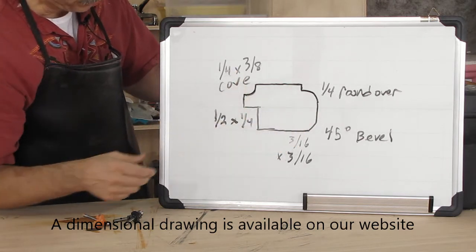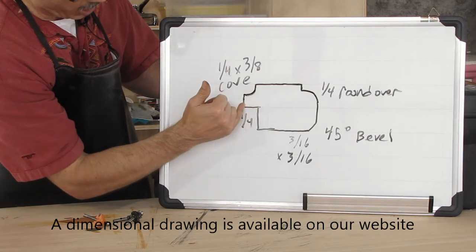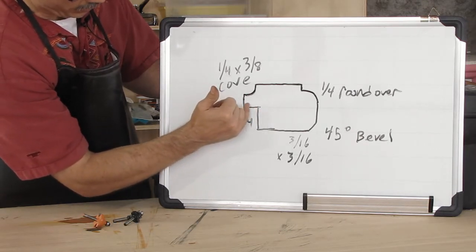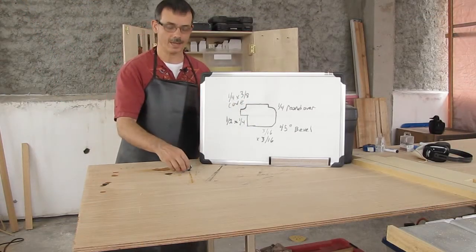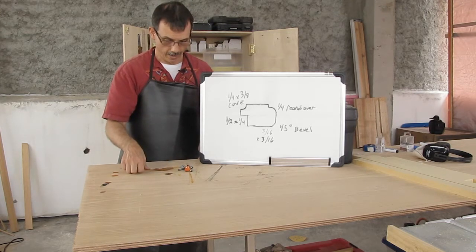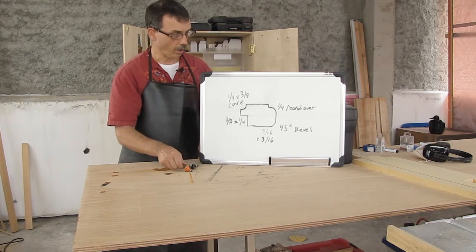I thought I would try that. And on the front, I'm going to be cutting a notch for the picture, 1/2 inch deep and 1/4 inch wide. Now I'm going to put the exact bits that I used and their sizes in the description. And I'm sure that most of you have these bits if you have a router already.